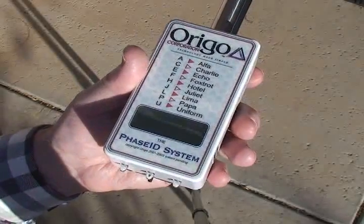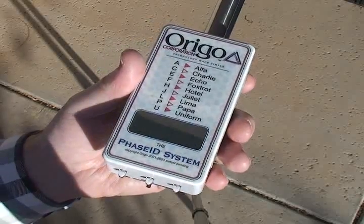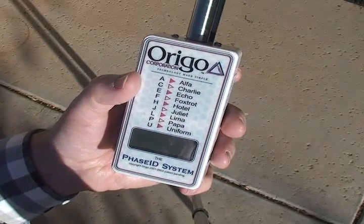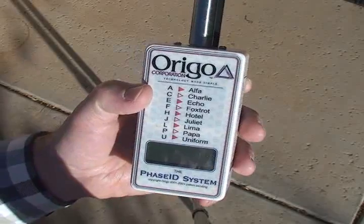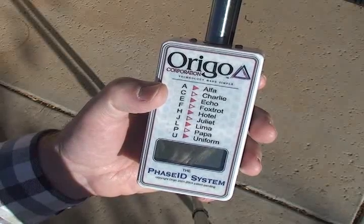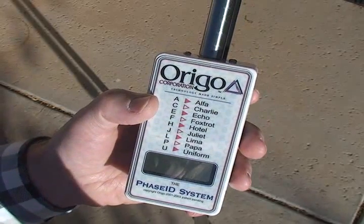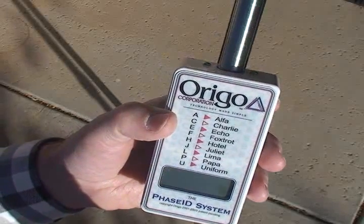So if you're in a substation or a crowded area where there's a lot of interference and so on, it's a good idea to, before you go to that position, just walk away a short distance and find a good view of the sky, and that way it'll lock up quite quickly. GPS satellites are always moving, so if it doesn't find 4 visible, or it has a lot of interference, it can take a very long time to lock up. Where if there's lots of satellites available and you get a clear view of the sky, you'll typically lock up in a minute or less.